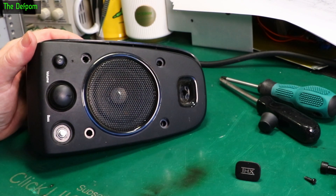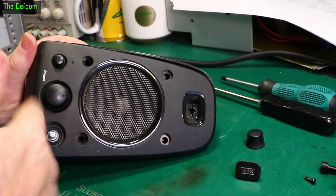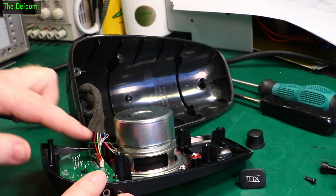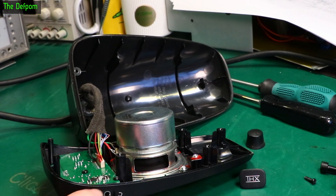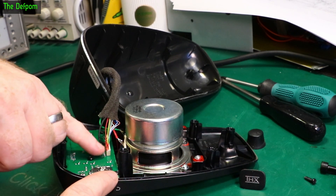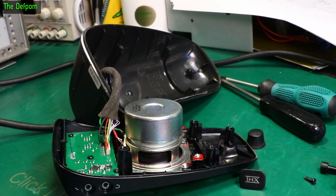That's a mission getting them out. Anyway, maybe I can keep working this one. I think it might be glued on. So I'll keep trying to get this one off, then I'm going to take the circuit board out and clean the control at least. Because I think I might need to dispose of this connector - I might actually just need to cut all this off and solder straight onto the circuit board and not have a connector there. Because there's obviously a broken wire, probably around here somewhere. You don't mess around trying to re-crimp these connectors. Just cut them off. Be quicker and probably better long-term.